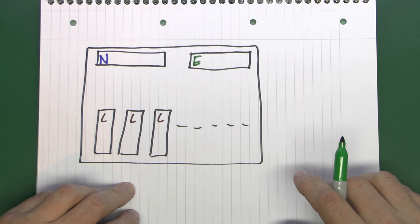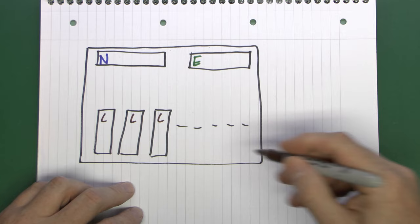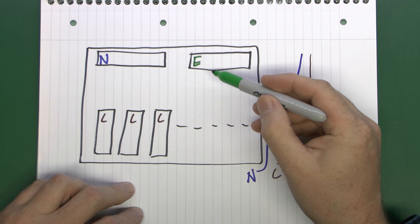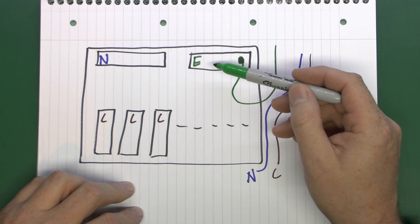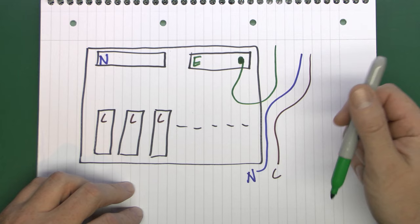This test is done with the power disconnected — for a new installation it will be done before any power was even put near it. Once you've removed the wires, you'll have the line conductor and neutral coming out, while the protective conductor or earth needs to remain connected to the consumer unit. This is important because it means the protective conductor for the circuit is now connected to the earthing for the installation, so you're testing between the actual conductors and the installation earth itself.